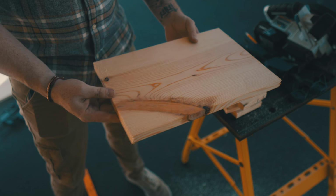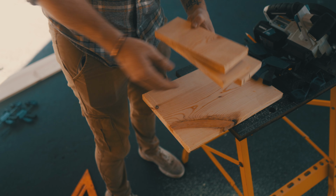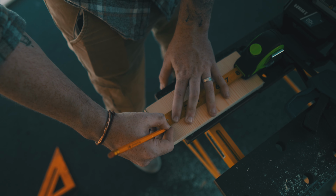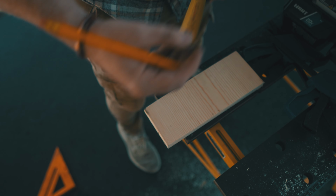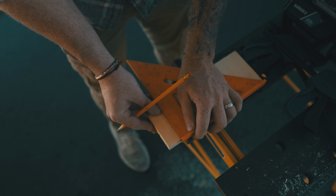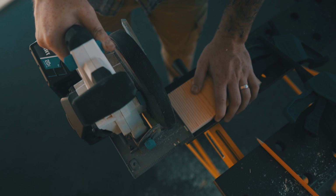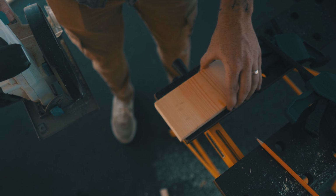Now what I wanted, I don't know if the Grovemade ones actually have this, but I wanted a little bit of an overhang between the edge of the top part of the shelf and where the legs hit. I wanted a little bit of an overhang just so that it's not perfectly flush the whole way around. So I basically took the 3 legs that I had and the shelf part and I took 1 inch off of the depth. 9.25 was their actual depth before I cut them down, and I brought them down to about 8 to 8.5, anywhere in and around there. That just gives me a little bit of an overhang at the edge of the shelf that I will show you at the end of this video.